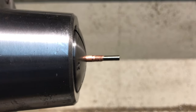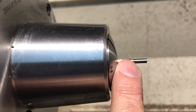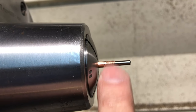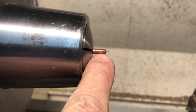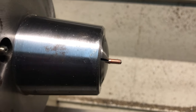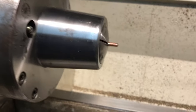I've threaded the first portion of the 5/32 inch copper tube. One thing I wanted to point out is I found on eBay a really nice quality 5C collet chuck for 5/32 inch — it cost about $10 or $15. It was worth it, because it's really tricky to get this threading done. I had to do it by hand with my tailstock die holder. I crazy-glued a drill bit in there too to give it some support — that came out really nicely. This is the second half of the 5/32 by 40 threaded portion. In this case I didn't crazy-glue the drill bit; I just put it in all the way to the end, then put a 3/32 inch piece of steel rod in from the other end and taped it, and clamped this thing down super tight using that 5/32 collet. Used the tailstock die holder, did the threading completely by hand, and it came out beautiful.